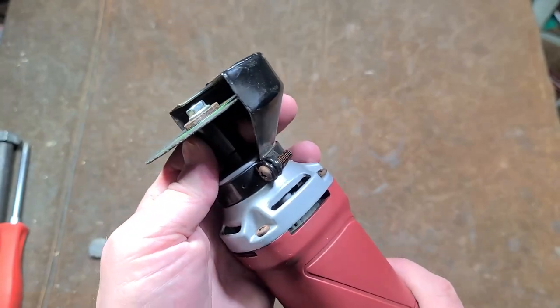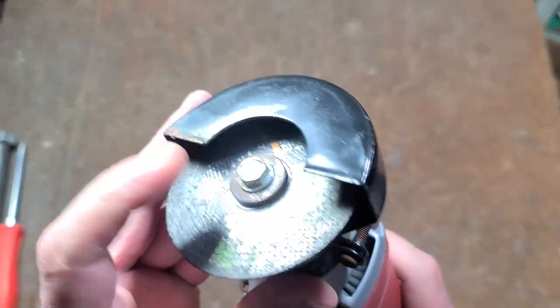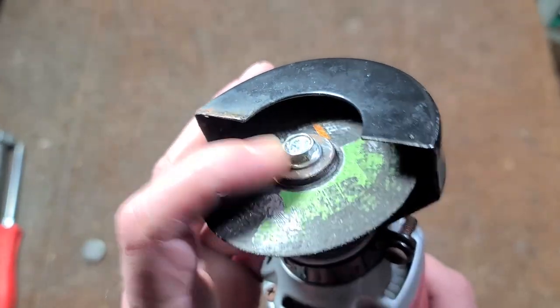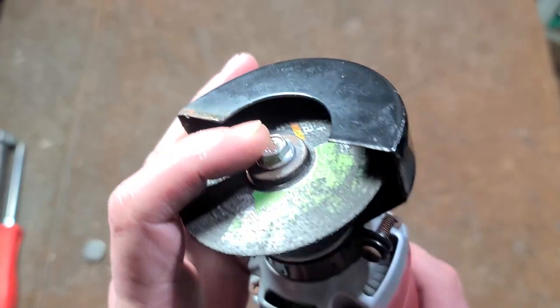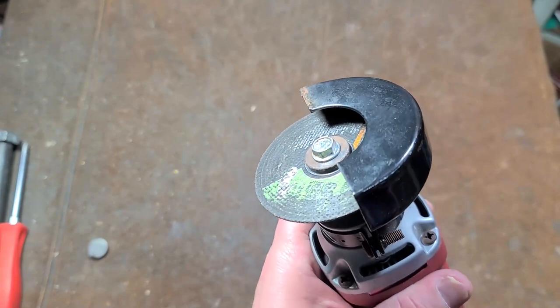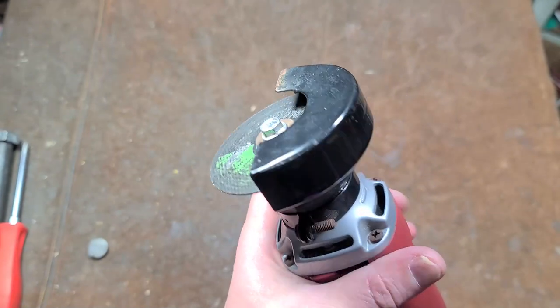At least it's ball bearing, and the bearings are pretty tight. It used a five-millimeter socket head cap screw, which was annoying, so I just replaced that with a grade 10.9 ten-millimeter fastener, just so it was easier to deal with when replacing the blades.